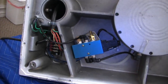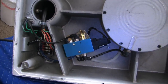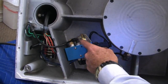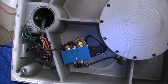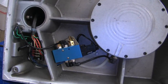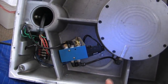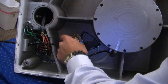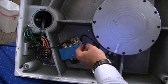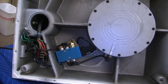We can't have that thing driving down at normal speed or it's going to make a loud noise. So we control the speed with this speed control, to allow it to come down slower than it goes in the up direction, which is just a muffler. Going up this way, it's porting to this, and then exhausting from this. This exhaust is taking out the air that's already in there so we can move it up.